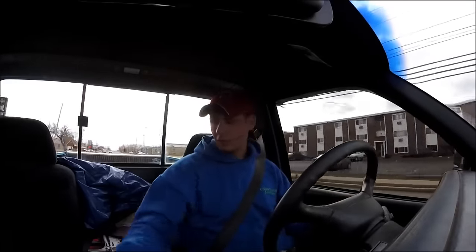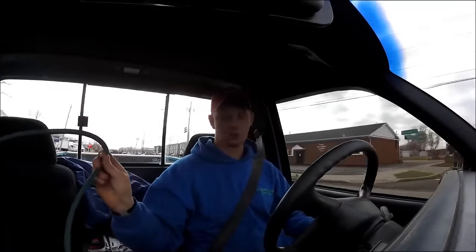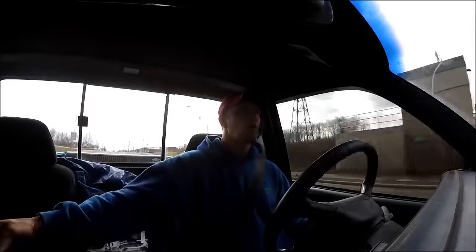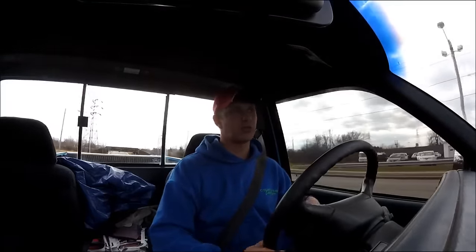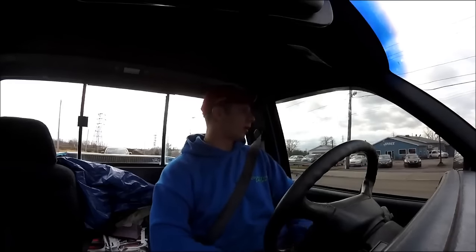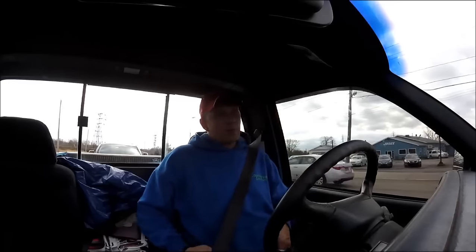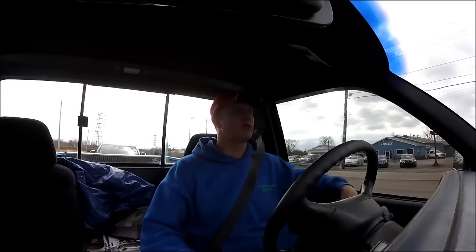All your mowers - you run all your belts, you should have a backup. $68.91 is the cheapest, and some places want like $74 bucks for that belt, and it's just the black standard issue belt. What I like to run are these green ones - kevlar. I go to NAPA, and I'm sure there's other parts stores if you don't have a NAPA in your area. I take the belt there before the belt even breaks, take it up there, say 'measure this out, I want another belt just like it and I want it in the kevlar.'